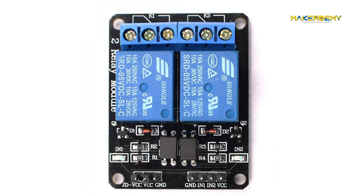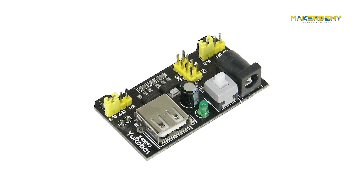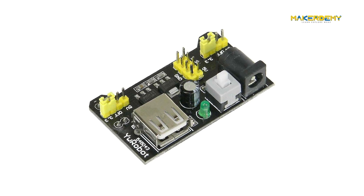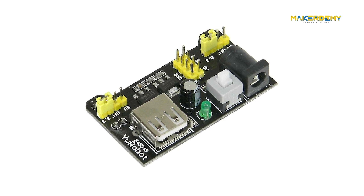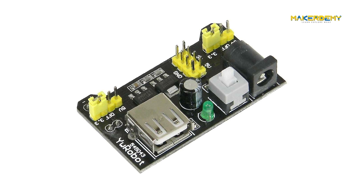Now, let's interface the Raspberry Pi with the two-channel relay. The two-channel relay has four pins to interface with Raspberry Pi: VCC, Ground, IN1, and IN2. The relay module needs 5V input at the VCC pin and more than 30 mA of current to work. This is why we need an external power supply to provide the obvious deficit in the current. Here, we will use a popular external power supply board called the MB-102 breadboard power supply.